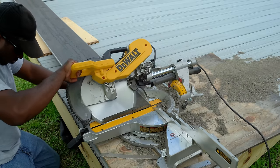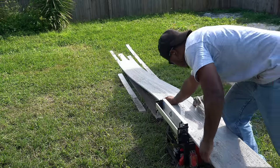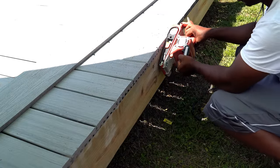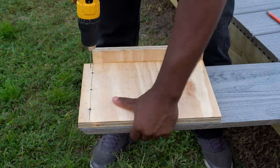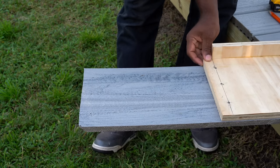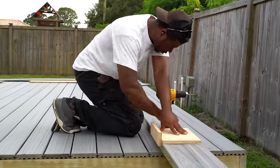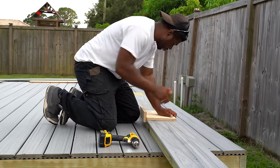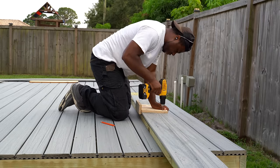Since I'm going with hidden fasteners, I'm doing my best to go clean with miter corners. I used a 12-inch fascia which I ripped down on the table saw, slightly bigger than the total of the deck frame and deck board. I sanded and cut down both ends of the deck boards so they're even with the deck frame. I also made a quick jig that allowed me to drill all the holes at the same distance apart — set up to mark three holes at one time, keeping them one inch from the edge. I'd mark the back side with a pencil, move the jig, and drill the next set. I only drilled the fascia board I was planning to install at that particular time.